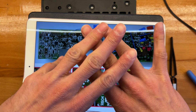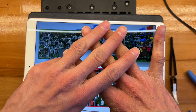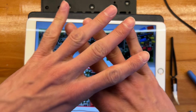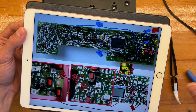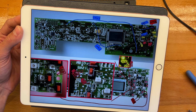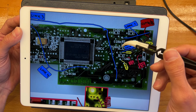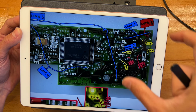All the buttons are in a matrix. So let's say you have just 6 microcontroller pins and you want to interface more than 6 buttons. So you link them this way and you put buttons at all the crossings. And this way you get 9 buttons. With 4 you get 16, with 5 you get the point. So all the buttons and everything, keyboards, remote controls, all of them are multiplexed, or even Charlie-plexed. And it's pretty complicated to take them out of the circuit because you need to leave the rest of the lattice intact, right, and just take your buttons out.